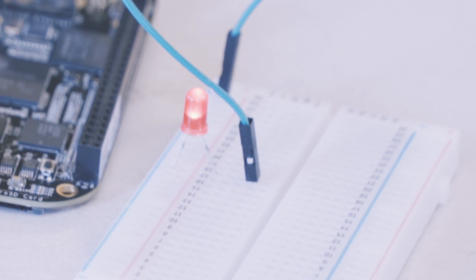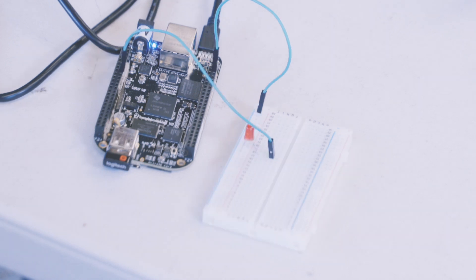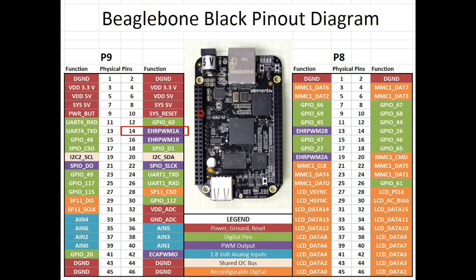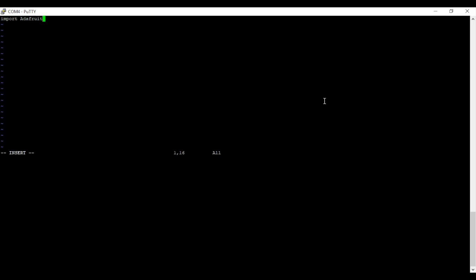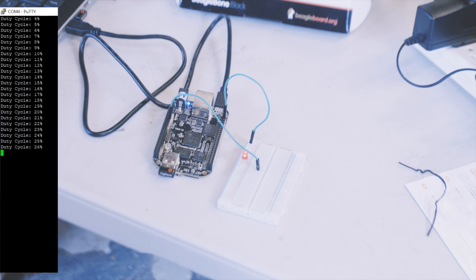Now let's test out PWM. If you don't know what PWM is, there's a link in the description. We'll use the same circuit as before, except the anode wire needs to be moved to a PWM pin instead of a digital pin — we'll use pin P9_14. Open a new file with VI and write some Python. Import the library, then progressively make the LED brighter by stepping up the PWM duty cycle from 0% up to 100%. Do a loop counting up by 1%, with PWM output on pin P9_14 and the loop variable as the duty cycle. Import the time library and sleep a bit during each iteration so we can see the LED slowly get brighter. Add a print statement to see the duty cycle value. Run it and there it is — the pulse width modulation slowly changes the brightness of the LED as the duty cycle, and hence the voltage and current, slowly go up as the loop counts up.